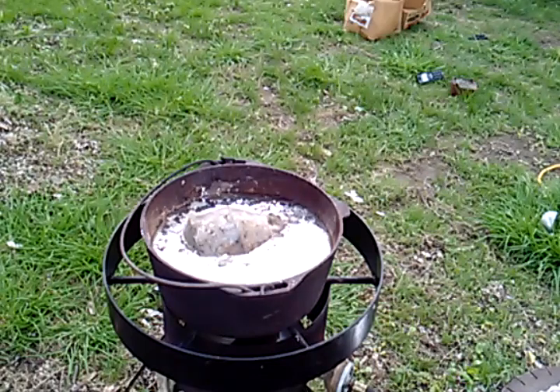That way, if you have a tin mixture in it, that's going to get your tin nice and hot. If you're running any kind of antimony, that's going to keep it nice and hot. And also, when you flux it hot, it tends to get the trash out a lot easier.